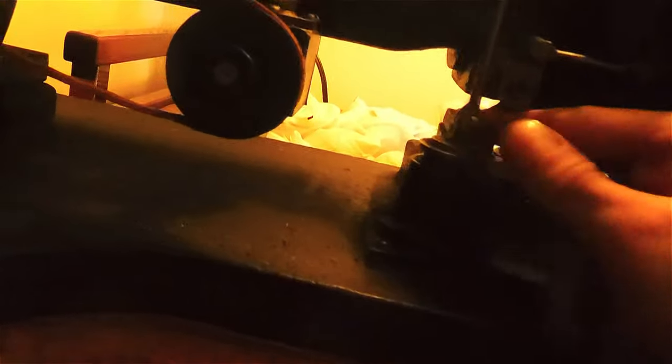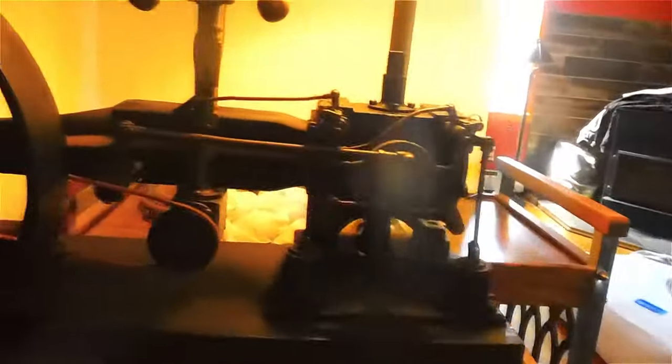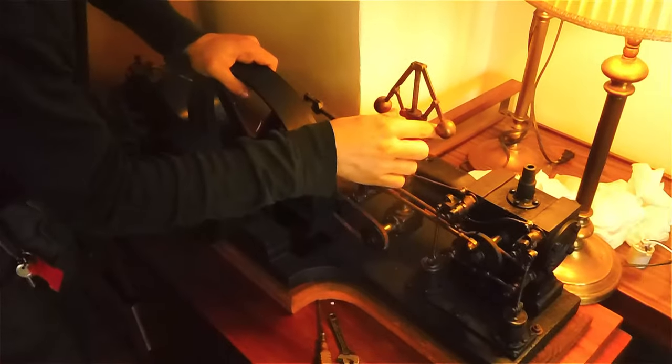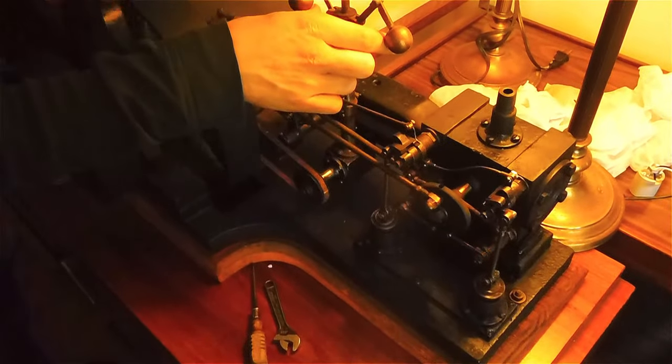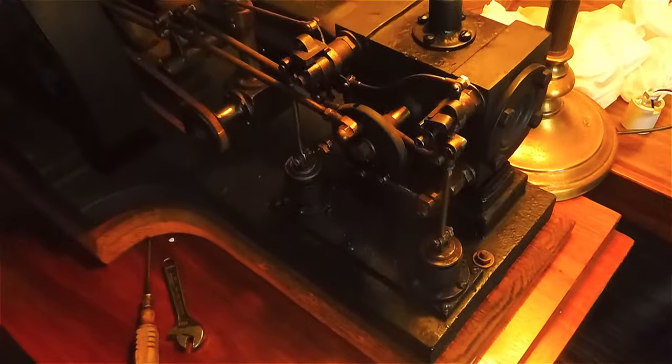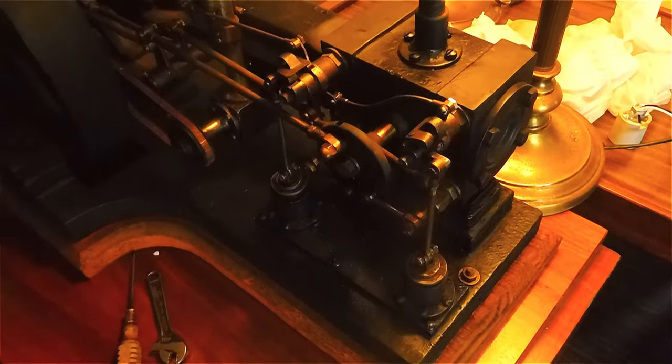If I only had a steam source right now, I'd give it a whirl. This dashpot here is sticky — I'll have to see if there's check valves in the bottom underneath them, because they're supposed to have vacuum checks. I don't think it'll trip because the dashpots are too sticky right now. But you see the latch is going over where it's supposed to — drops it. So we've got to clean and oil the pots. But that's great — that's done. Perfect. Thank you, John. So steady work — we're going to have a dynamo, I think maybe a one and a half horsepower.